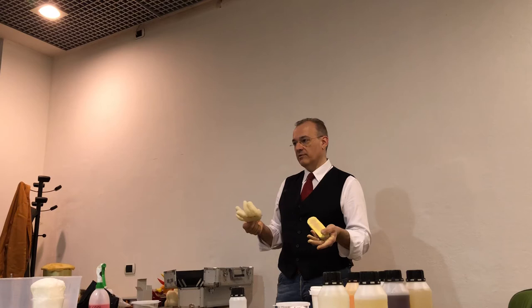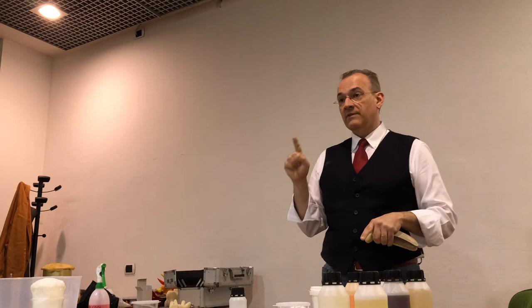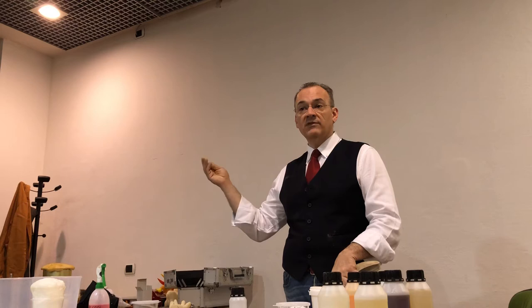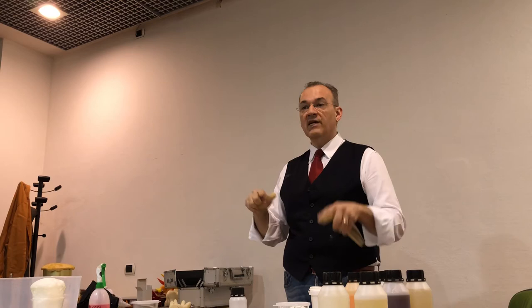Other thing, remember that this material reacts, as I told you, and expands with water. It means that if you make your mold today that is raining, and when it's very hot outside and very dry, you will achieve completely different results. It will expand much more.